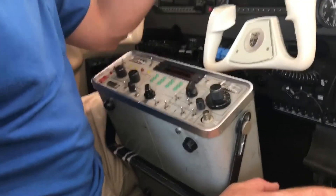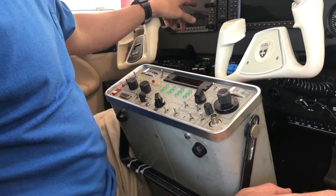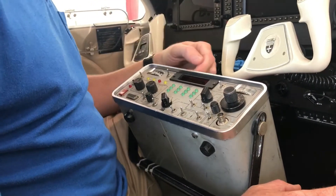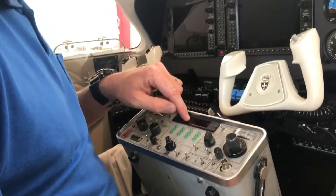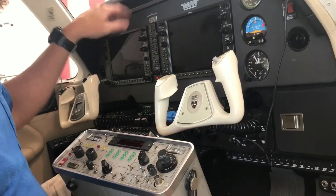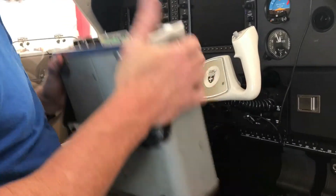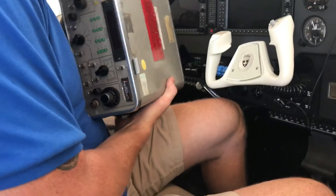The reason why — you can use it if, say, we were doing an aircraft that doesn't have a display of what the altitude is. But this one does. So I don't need to sit here and watch it all run up on the memory. When I go to this altitude and it was minus 100, on a unit like that I'd have to watch it in here to see what the encoder is putting out. But on this I can see it right on the screen. Because I saw that it's putting out at minus 100, which is what it was on the test on that screen, so I don't need to watch it on both things.